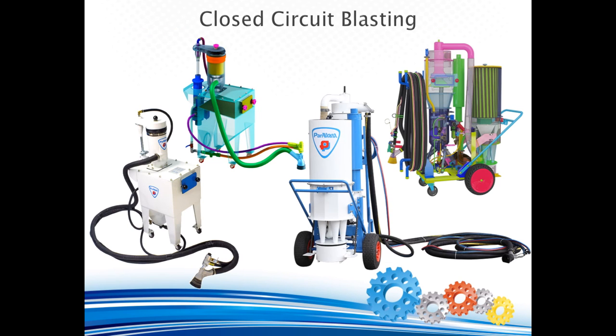Similar to blast cabinets for heavy-duty applications, Panblast has a pressure blast version of the closed-circuit blaster in the form of the AER215 Nuovo. It operates similarly to the AER85, but is much larger, rugged, and has a higher production rate than the AER85, and with more flexibility in the type of abrasive media which can be used because it is a pressure blast instead of a suction blast system.